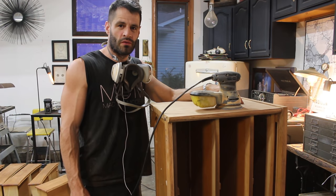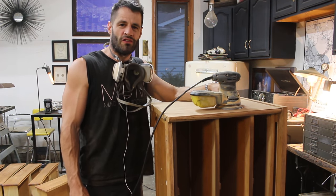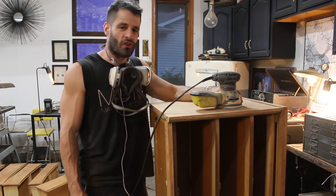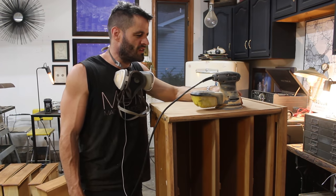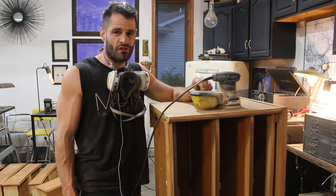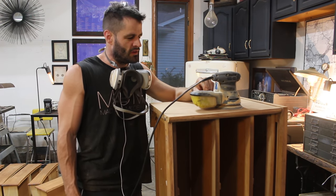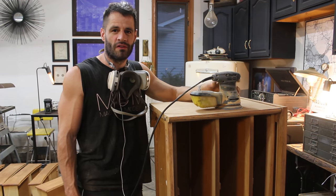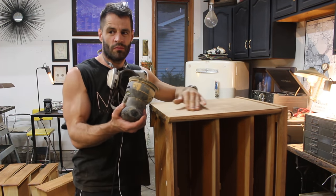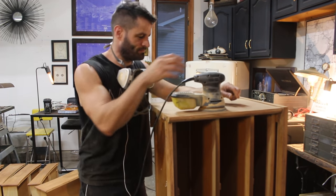So I realized towards the end of the scraping process that this is basically what you saw in the last video. So for all of you faithful subscribers, I apologize, you have to see this in back-to-back videos, but for true restorations, 75% of the work is prep work, scraping, sanding, and it's no different for this one. So I'm gonna go with the 220 grit on the orbital sander, prep this for staining, and then the final top coat.